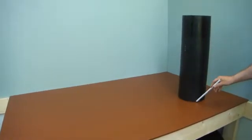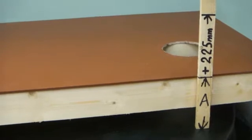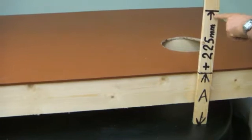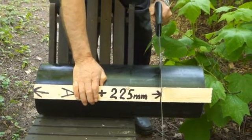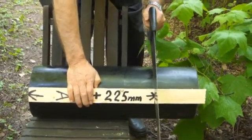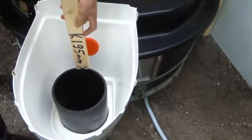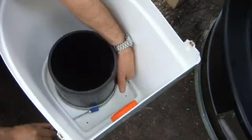Lift the cover to its place. Mark a hole of the sewer pipe on the floor so it can be opened. The length of the sewer pipe is the length from the cover to the floor surface plus 225 mm. Saw the sewer pipe into the correct length. The right depth is 195 mm from the bottom. The pipe is tightened to its place. Holes on both sides are covered with protective caps.